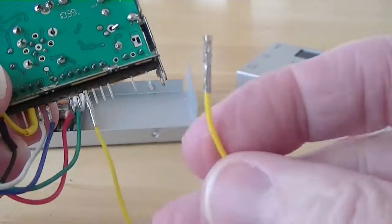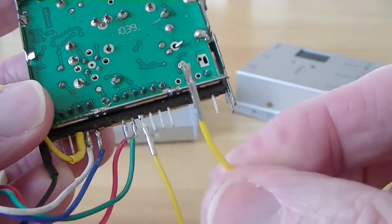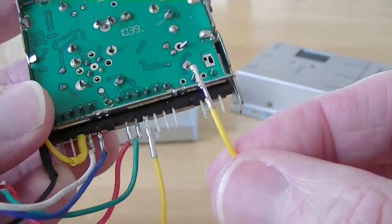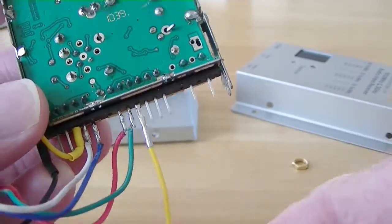This is going to put out a signal between 5 volts and ground, or zero. If you've got good RSSI — 100% — you'll have 5 volts, and if you have none, it'll be down near zero. You can run that pin out to your diversity controller.